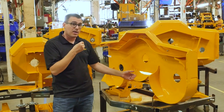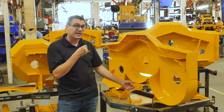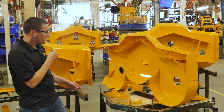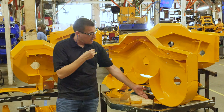We've got a lot of features here to reinforce it. The backing plate is welded both to the baffle and the side baffles to reinforce this back skirt. This can easily get hit if you go over something just below the height of the blade and it snags — you don't want that to get bent. The plate back here helps with that. On the hip of the deck, we also have the piece that the stripe kit is mounted to.